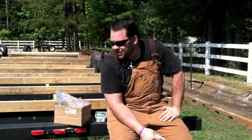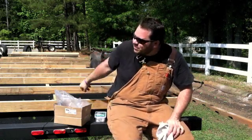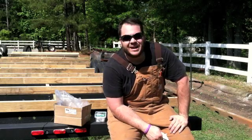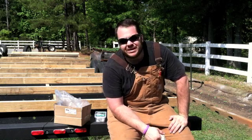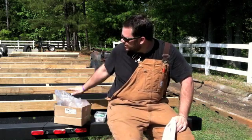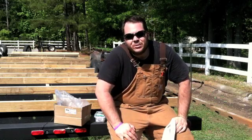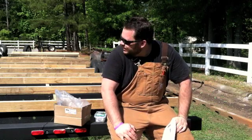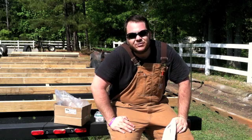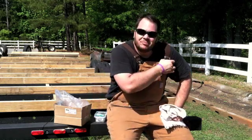We got a lot done so far. We got the floor joists attached to the frame all the way up, but we haven't bolted them down yet because we have to put our radiant barrier in first. We're going to pull the joists back up, lay the radiant barrier down flat across the trailer, put the floor joists back on, and then bolt them in. You can see the bolts are countersunk — they're carriage bolts — so there's a nice flush area for the subfloor.